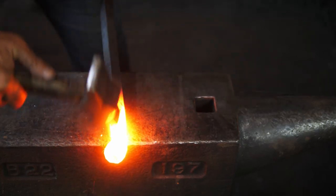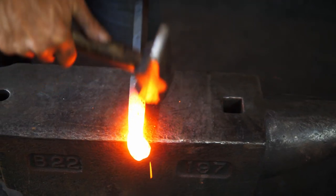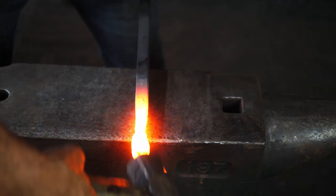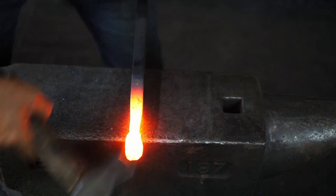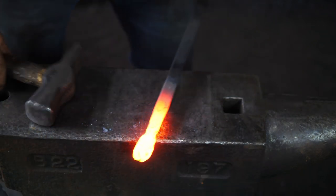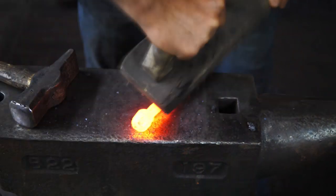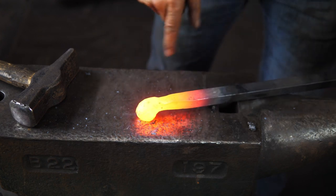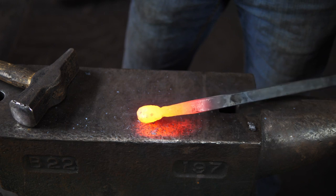I just want to knock the corners off what will be the top of the jaw, and now I just want to take a final look at the skull itself — trying to put a bit of a center crown on there. We are ready to go to the vise. The facial features are going to start happening now. Holding it in the vise, with various punches I will start popping in the facial features.